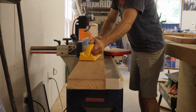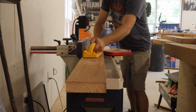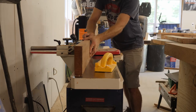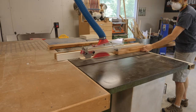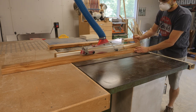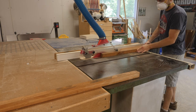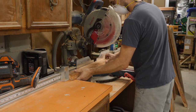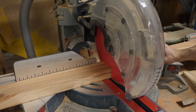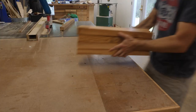This project is built with reclaimed southern yellow pine from plans that I have available on my website. To begin milling stock for the legs, I start off on the jointer and establish two flat surfaces that are square to one another. Then at the table saw I rip the boards to rough width. I cross cut the boards to rough length at the miter saw and then glue together two boards per leg.